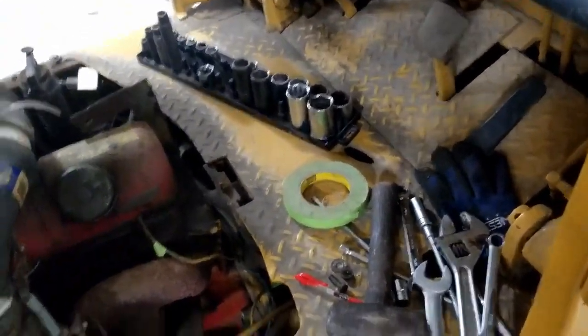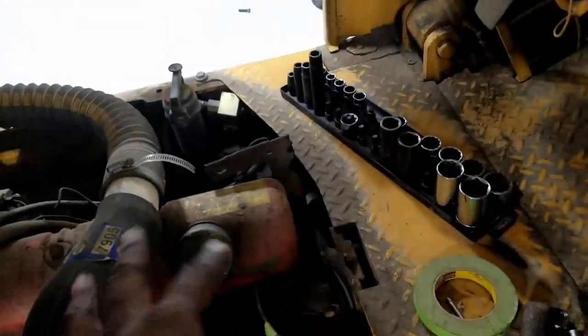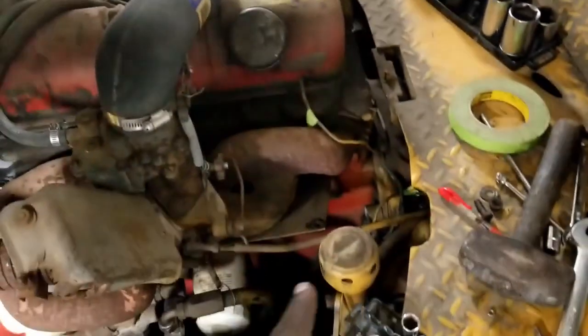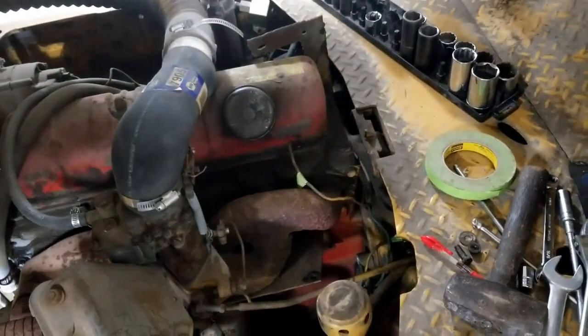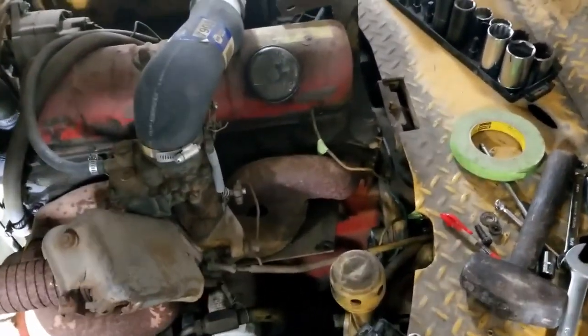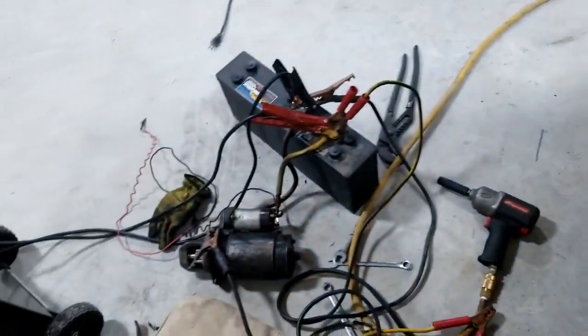When I tried to start it, it clicked. There was a noise coming from over there. I haven't been able to isolate the noise that's happening on this side, but over here, it was making a motor straining type of noise. I did not know if the starter was bad. I checked the voltage at the starter, and there was voltage at the switch.